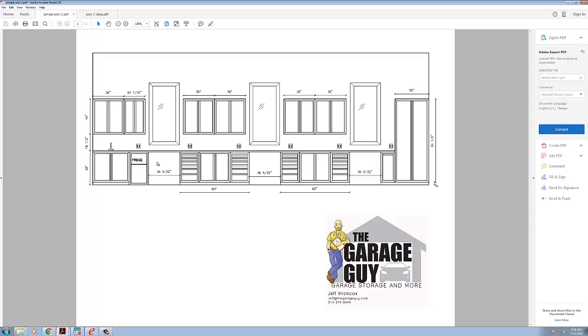All of this is doable. My biggest beef with putting the refrigerator up in a wall cabinet is you won't be able to reach the freezer without a ladder, I don't think. I think most of these top shelves are going to be step ladder kind of situations with most of these cabinets. You might be able to reach them, but it's going to be a stretch. Another issue with the refrigerator is it's going to defrost and leak water. I can accommodate that and let it leak out without causing damage down here. I don't know if it would be so easy to allow it to defrost, or if it gets unplugged or the power goes out, not to create damage on the bottom of this cabinet and still have a cabinet that looks like the rest and be waterproof.